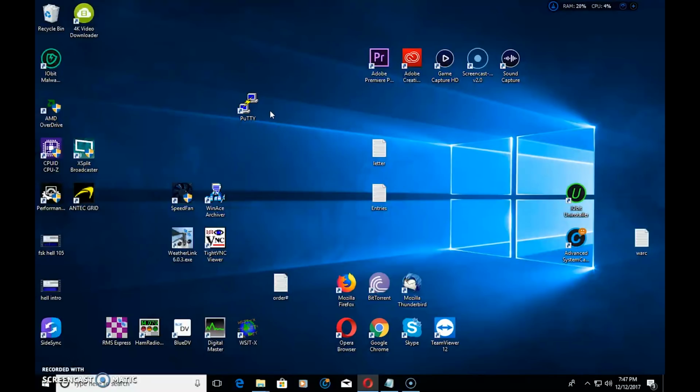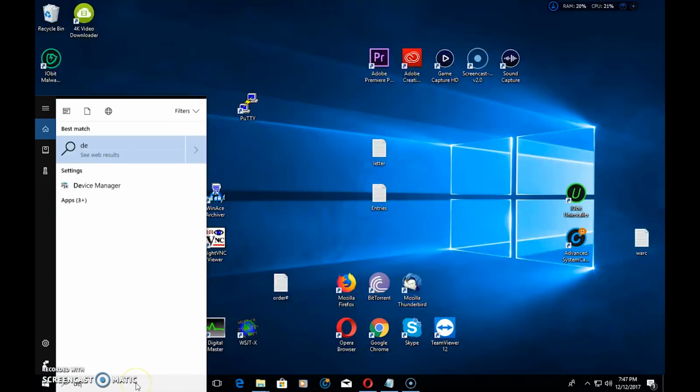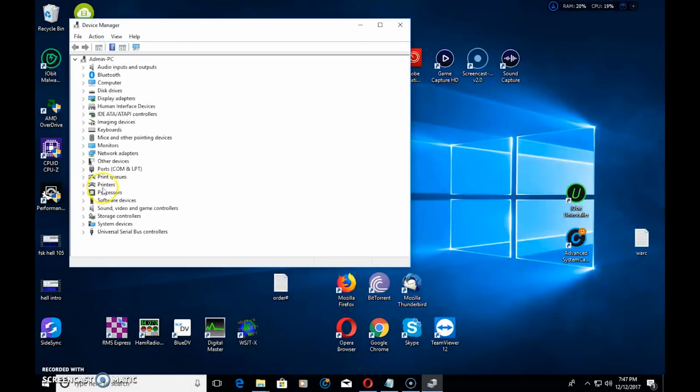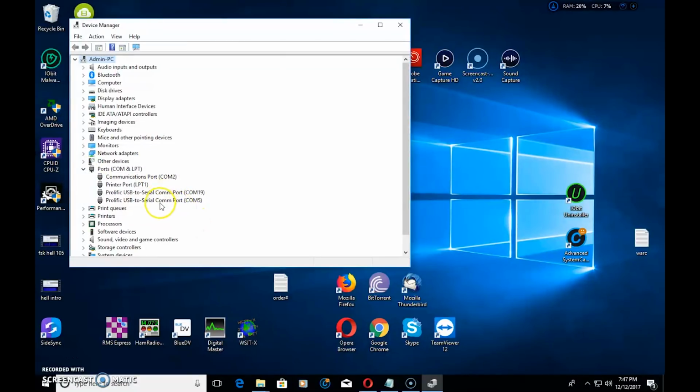So if you want to look in the manual, pretty simple. In the description below of this video, it shows you a download link for PuTTY if you want to download that for your operating system. I'm on Windows 10. So if you have PuTTY installed, next thing you're going to want to do is go to your device manager. Device manager, in ports, will show you what ports are connected right now. I don't have the device connected. So when I plug it in, it's going to add a COM port, and I'll be able to tell which COM port that is. It added COM port 3. So I know it's COM port 3.